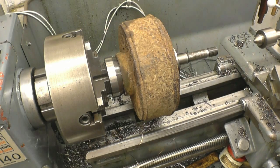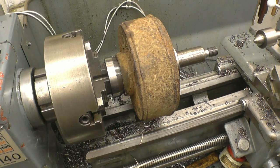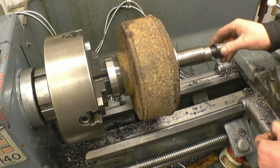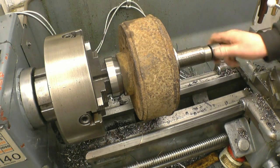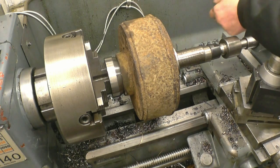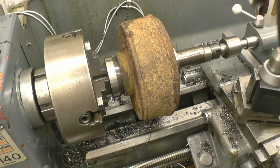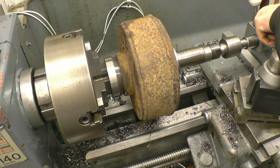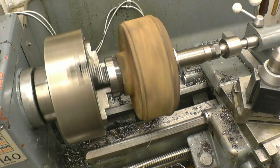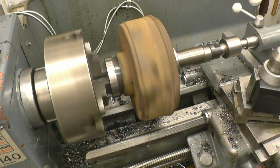I can see what works now — that just goes in between the two tapers. Give enough space on here just so the nut tightens up. I think this will give enough drive gripping on those two tapers. That certainly appears to be running true. It runs true because it's been gripped on the two tapers that have been machined on that mandrel.